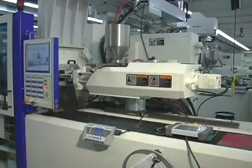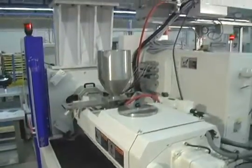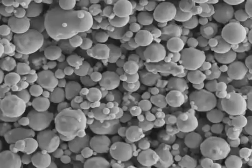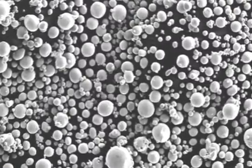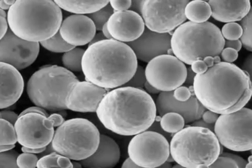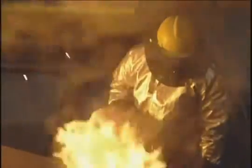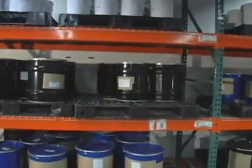Metal injection molding, commonly referred to as MIM, combines the unique metallurgical capabilities of working with metal powders and the shape-making advantages of injection molding. The process begins with the use of very fine powders, generally below 20 microns and often smaller than 10 microns. These powders, which are preferred to be highly spherical because of the flowability characteristics required in the molding process, are generally produced by atomization, mostly using high-pressure gas or water, although other production methods are also employed, depending on the metal involved and the specific microstructures and properties desired. An extremely wide variety of metal alloy compositions are possible with MIM.